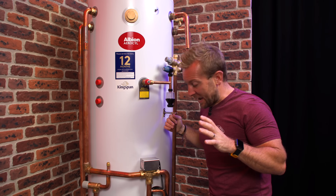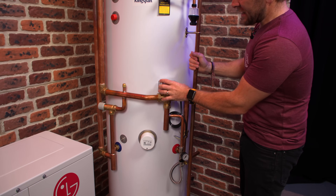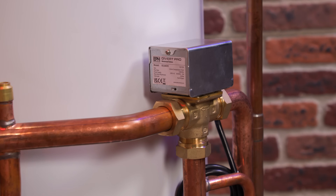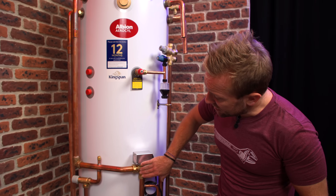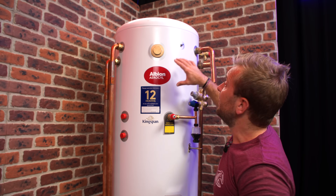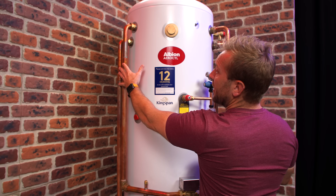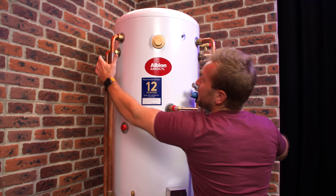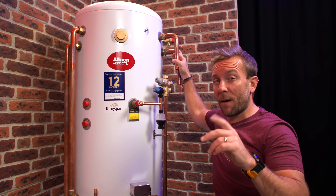So these pipes going in and out — what do they actually do? We've got a flow coming in from our air source heat pump into here, and we've got a standard three port valve. When our tank is calling, the three port valve will divert into a coil which is 28 millimetres, giving a really big heat transfer rate — which you sometimes need with heat pumps — and then it goes back to the heat pump to be heated. When that's satisfied, we divert up into our buffer tank. There are no coils in here, just a big tank full of water, and that water is shared by the flow from our air source heat pump and also these two pipes here which are the flow and return for the heating system.